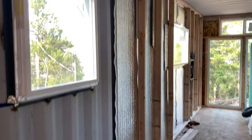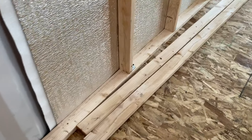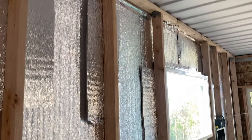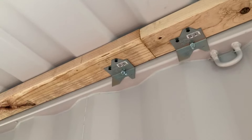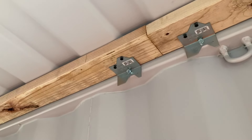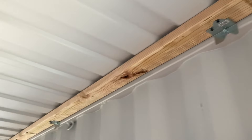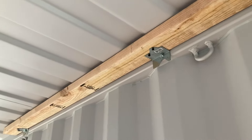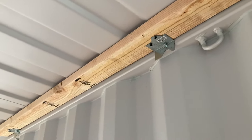I use double stick tape to attach it to the sides, and then I put a 2x4 sill plate down, attach it with screws to the floor, and then for the top plate I just get 2x4s — I'm using 10-footers. I buy these angle brackets from Home Depot, attach them with inch-and-5/8 screws to the 2x4, and then use a self-tapping screw to attach the other side of the angle to the container. It sinks right into that — I think it's like a 2x2, 2-millimeter steel on the top — and that self-tapping screw sinks right into it really easily.